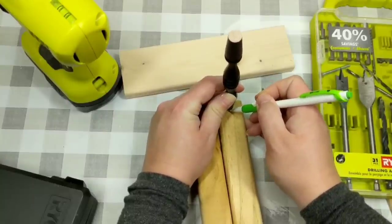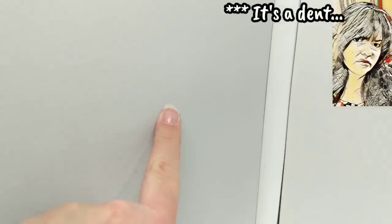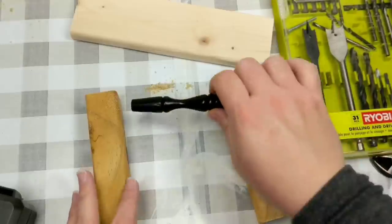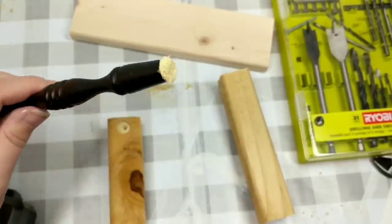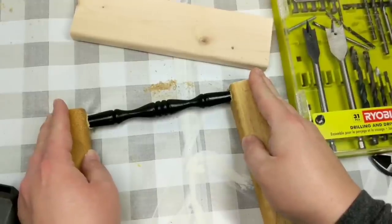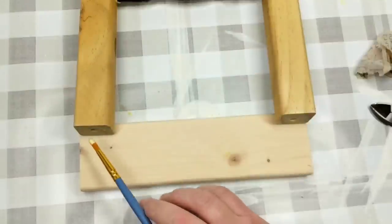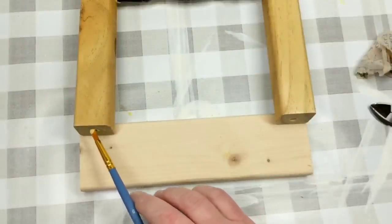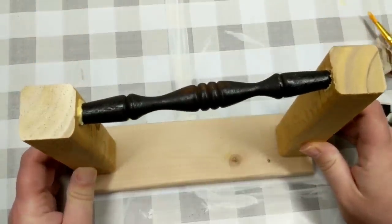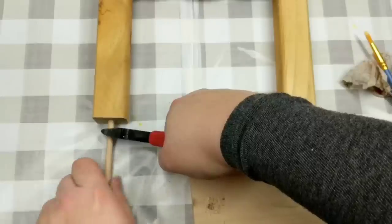To start, I'm marking where I'm going to drill the hole for our spindle and I'm using a half-inch spade bit — use whatever size you need for your spindle. I also put two holes in the bottom of our one-by-ones so they're prepped for the dowels we're going to attach to the one-by-two. Right now I'm using Titebond wood glue and a little bit of wood shavings to attach the spindle and drying it just a little bit to give it a head start. Then I take some wood glue around the inside of the holes and gently press it down where I want the holes to go — once you remove it you can actually see the ring, which is a little hack — then drill your holes and cut your dowels to size.